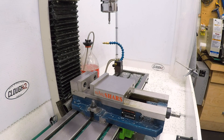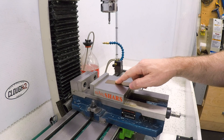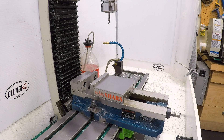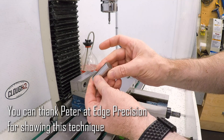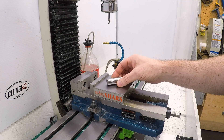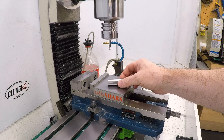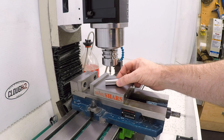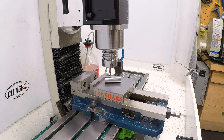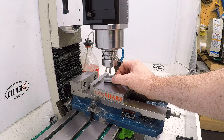There are a couple of ways you could do it. I've previously used brass shims and moved down until it just clamped, but that's not very precise. Instead, I'm going to use a gauge pin. This is a three-quarter-inch diameter gauge pin — you can buy these individually if you don't have a set. I just picked this up off Amazon for a few bucks. What we're going to do is bring this down until the pin cannot fit under, then slowly bring the tool up until it just passes under. I've got it dialed down so I'm incrementing by ten-thousandths of an inch, and I'm dialing in the upward direction only. You do not want to dial down.